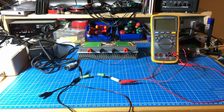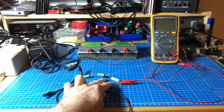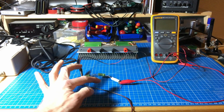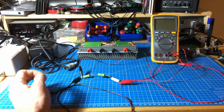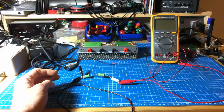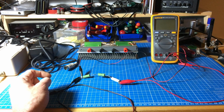You could measure this very precisely and stuff, but basically what I did, I made loads. This is a 25.6 ohm load that I made of some bigger resistors I had laying around, which is a bit higher resistance than the 0.5 amps that the 12 volt line has to pull on a full load. So it's not quite full load, but a little tiny bit lower, which is probably realistic because it won't run under full load on the floppy drive normally. So basically this is the load for the 12 volt line, to test if it can deliver the voltage at full load.